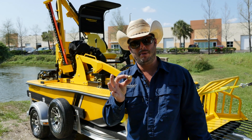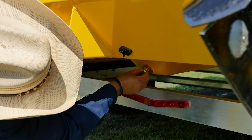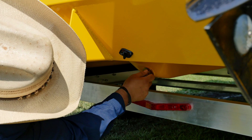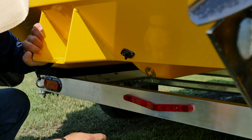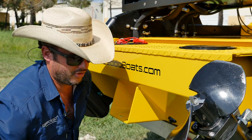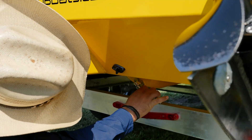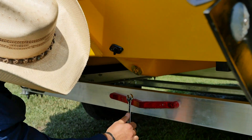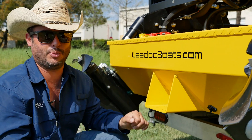Most importantly for pre-launch: putting our drain plug in. Down here on the transom in the center of the boat there's a spot where the drain plug gets installed. Make sure there's nothing on the threads — nice and clean. Reach up underneath here, twist it in hand-tight, and then take your 9/16 wrench and give it a quarter to half turn. You want it tight but not so tight that it'll lock up those brass threads.